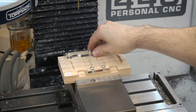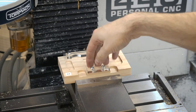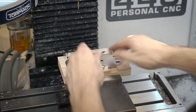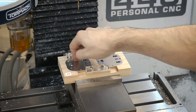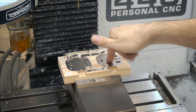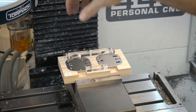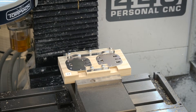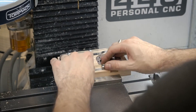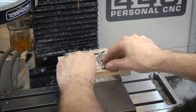Here is the finished — hopefully finished — jig. It's hard to see, but there's just a little bit of a lip right there and there that holds the clip underneath. This just simply slides forward and backwards. So if we take our clips with these features down, rest them inside like that, this should slide right over top, and now they are nice and secure. This could be a little bit tighter, but I can adjust that or put some tape underneath to raise these up a little bit. Really when I'm drilling this, all I care about is that it doesn't shift sideways and when the drill comes up it doesn't pull out — and there's really no way these can pull up and out. Changing them out is really easy: just pull that down, flip these up, put new ones in, clip it back, and you're good to go. Let's drill some holes in these guys and actually test it out for real.